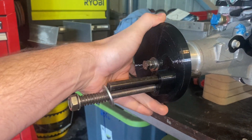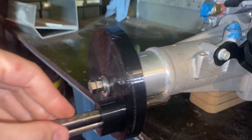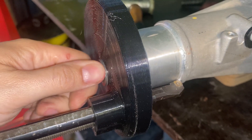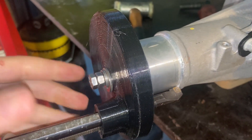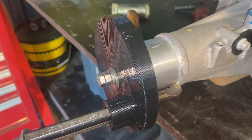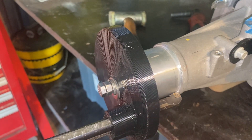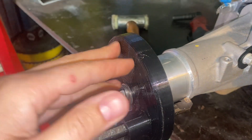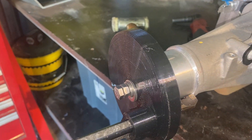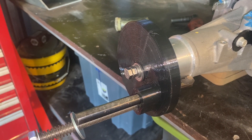Here we have it installed. If I was a smarter man I would have actually used a lathe tool, but I went the other direction. Some of the bought ones — you just put a drill on the end of the shaft and then spin it to make it do all the work for you. But being that this is a tool that's meant to feed from the right-hand side and cut left, it's got to go counterclockwise, which means it would undo that nut if I put a drill on there. So it looks like I'll be spinning this thing many, many times by hand.